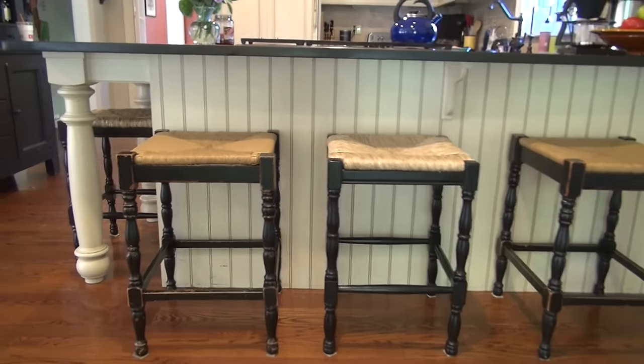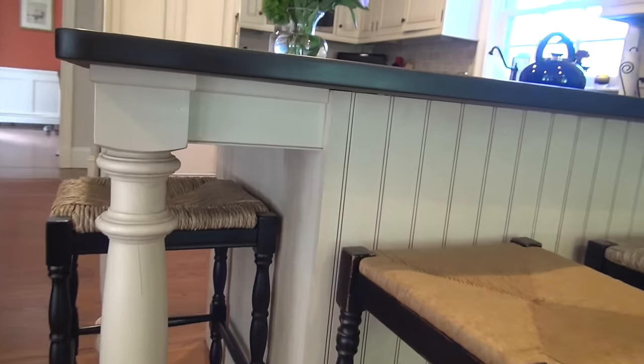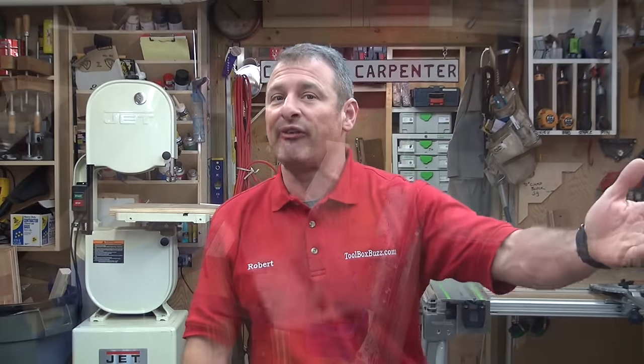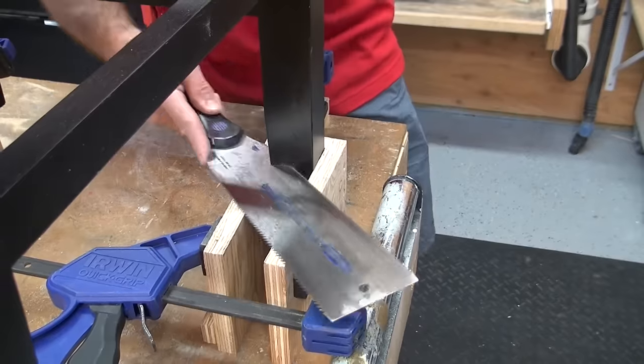You have two different bar stool heights, and sometimes kitchen counters can be even shorter because you have a skirt trim going around on long overhangs that are supported by furniture legs. So if you can't find the right stool to fit your kitchen and you simply fall in love with a bar stool and must have it, well then you've got to cut the legs down.